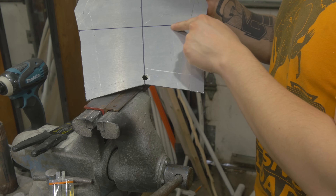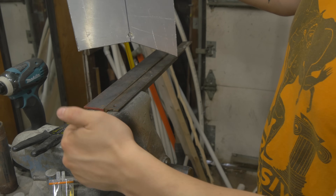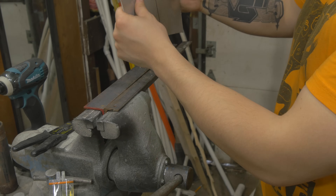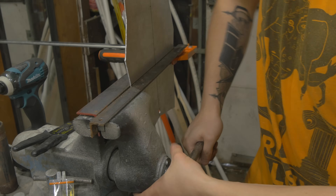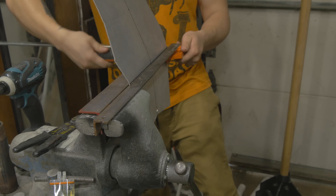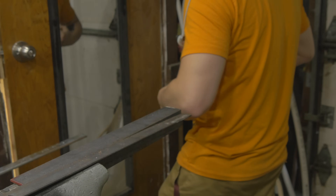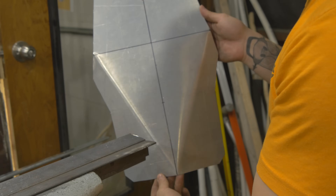Now I've got to make this long straight bend right here, which my vice would normally be able to take care of no problem. But this part is a little too long and can't fit all the way down in there. So I've put a couple of pieces of angle iron here to basically extend the vise. Clamp it up in the iron, clamp the ends of the angle irons together, make sure everything's super tight, now make your bends. Make another bend this way. It's looking pretty cool so far.